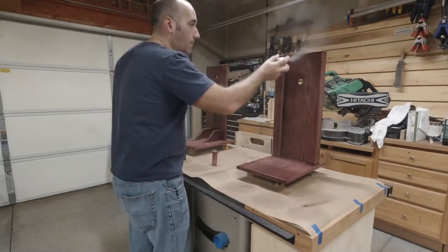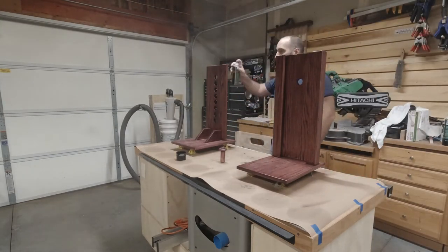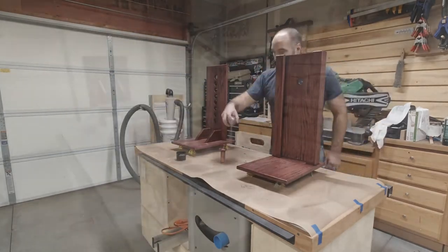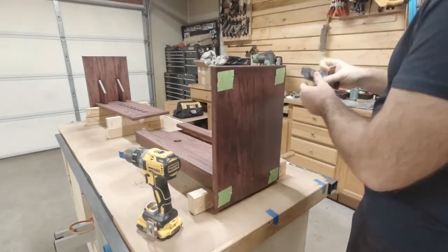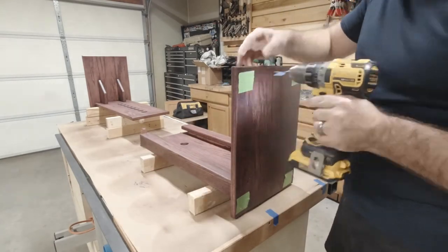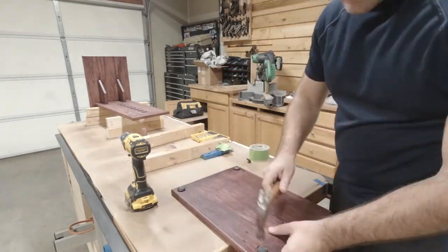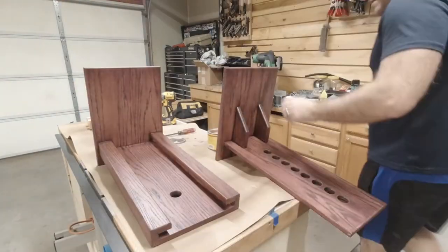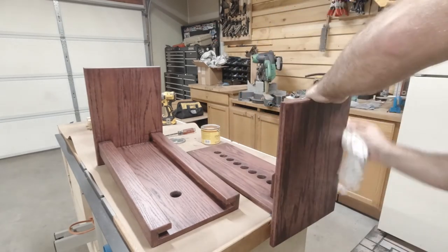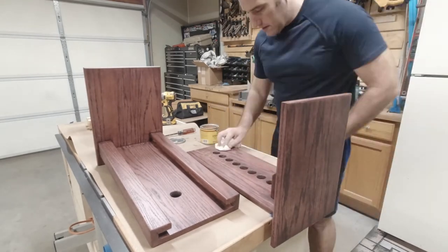After the stain dried, three coats of Helmsman Spar Urethane. I should have brushed it on for a thicker finish and it would have been cheaper, but I was lazy and just wanted to spray it. I did sand with 320 grit and then applied a final fourth coat. Now marking out for the feet on tape and pre-drilling — the feet nail in, but I pre-drilled to avoid any chance of splitting the wood this far into the project. Now for a wax job, about a week after the Helmsman was applied so it's curing. I wax it to give it a nice protective coating, and it makes the sliding pieces move a whole lot better against each other.